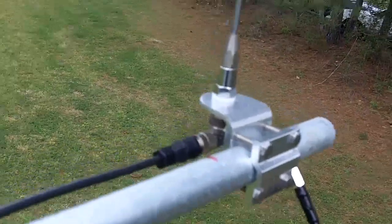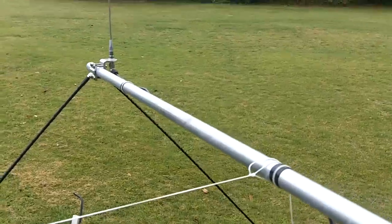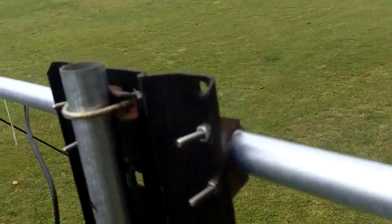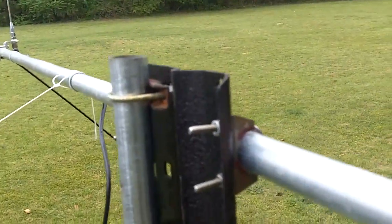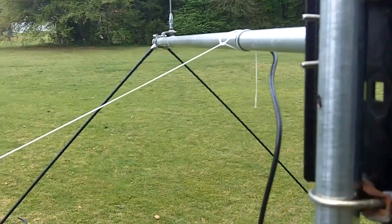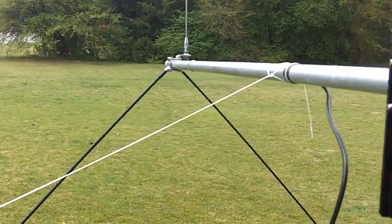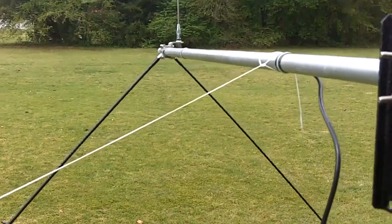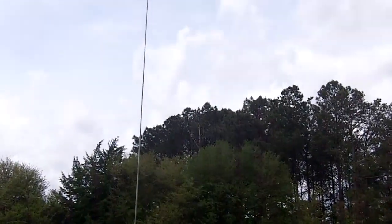Mirror mount brackets — don't do this at home folks, do not stand on or above this step. I put elbows on it so that the coax wasn't going straight down and then bending over to be attached to the mast — I did that on both ends. I have some temporary strings here so that I can turn the antenna from my garage window. You can see those ground plane radials are at about a 42-degree angle — 42 degrees is the absolute perfect for ground plane radials. It will give you better resistance and closer to 50 ohms. And the 102 whip going way up there.